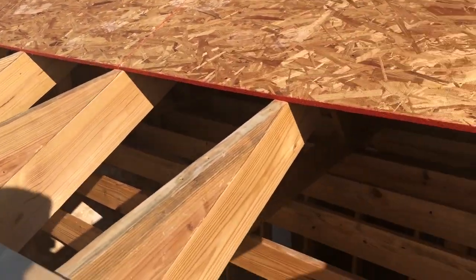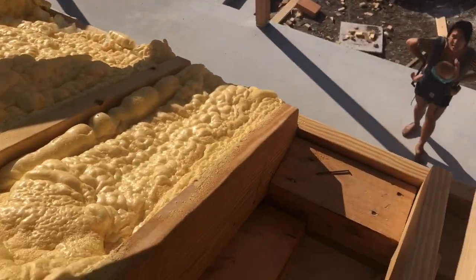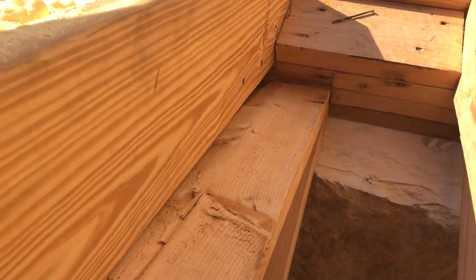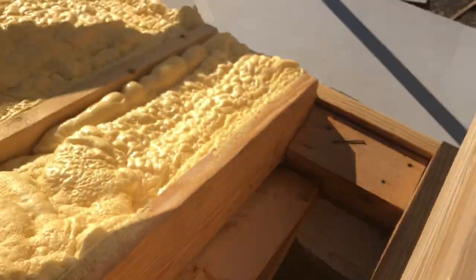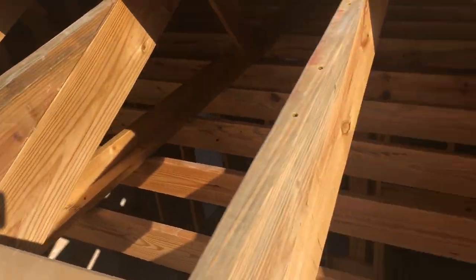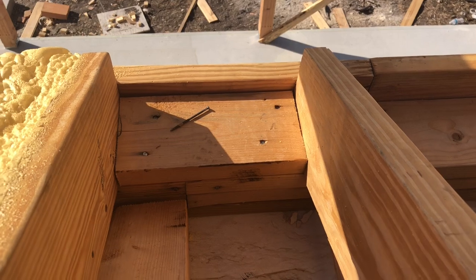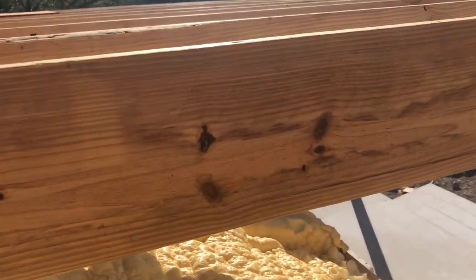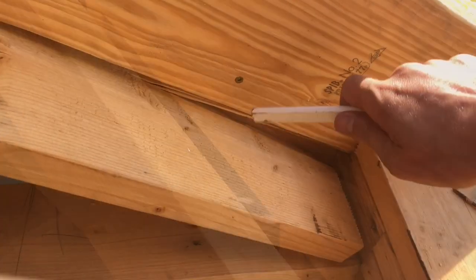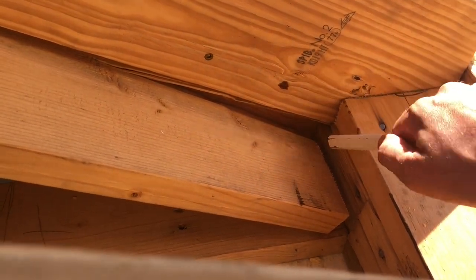We're standing up on the roof right now. You can see there are three two by sixes stacked — this is an attic truss sitting on top of a three two by eight top plate. Behind it is a four by eight Douglas fir beam sitting on one two by six. These attic trusses sit at a depth two two-by-eights higher than where the Douglas fir beams were framed out.